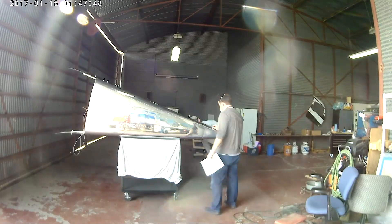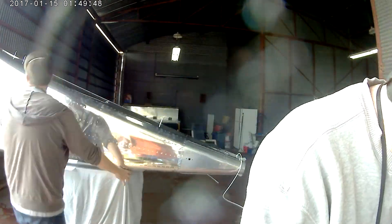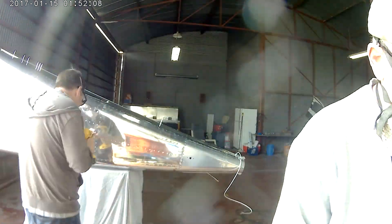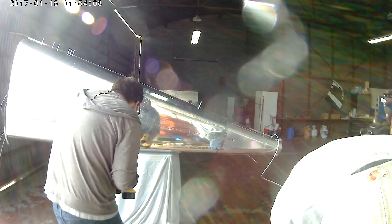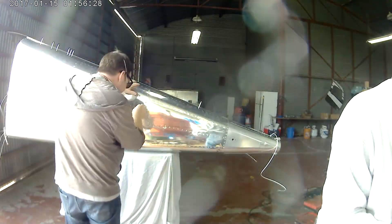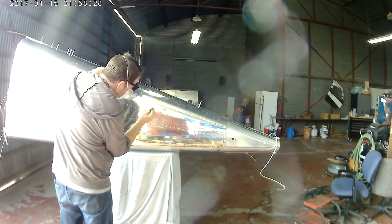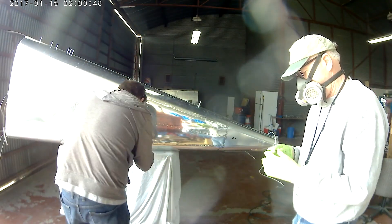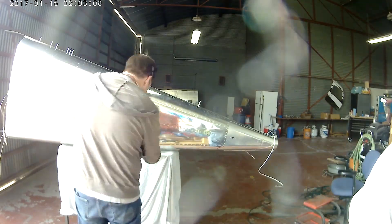On the outside there's a diamond-shaped plate that covers the center where the cracking was occurring. My friend Ted is here — you might be wondering about the respirators. This was during the horrible smoke event in San Francisco from the Camp fires. The air in Northern California was so bad people were walking around with full respirators. Here I am drilling out the 10 rivets you need — all the rivets for the center plate, plus a couple more on the side stiffeners.